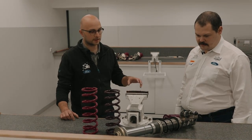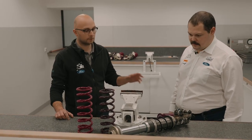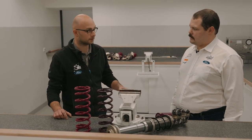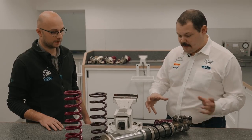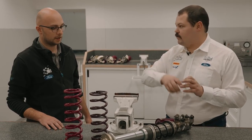Essentially, once the dampers have gone through quality control, we bring them over here where we put basic fluids inside, things like slide bearing oil and damper grease and so on. And we fit the dampers with the correct springs for the car. Fundamentally, the damper and spring is an assembly. You can change the spring.